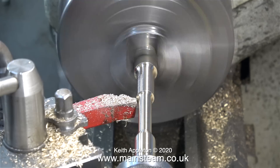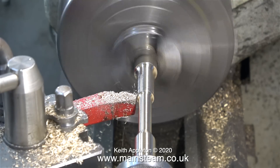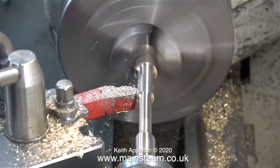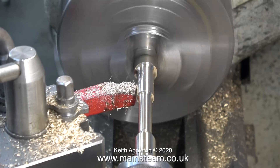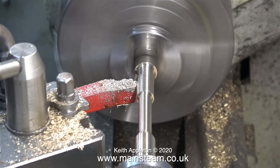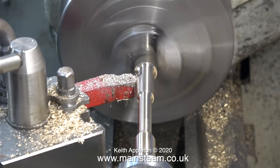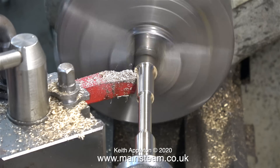Leaving the handle with an equal diameter at the top and bottom would make it look clumsy. Something worth mentioning: the other day I made a video about knurling tools, and I was very tempted to knurl the handle, but that wouldn't be a good idea. When running a steam plant with just a hand pump to supply the water there's quite a lot of to-and-fro action, and if the end of it was knurled, over a period of time it would make your fingers sore.